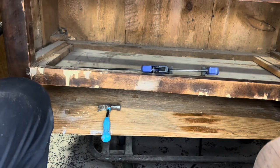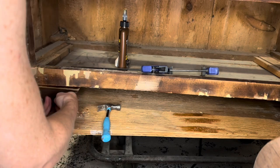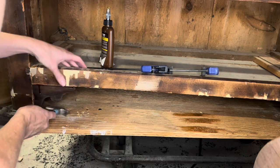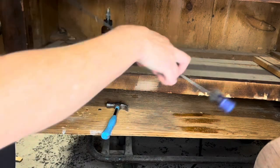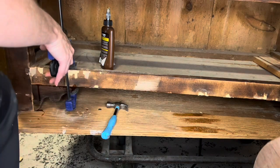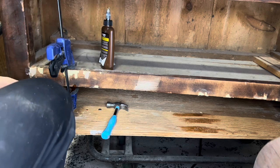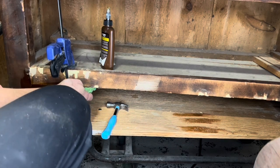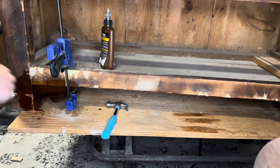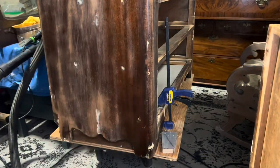And then that wood did not take the stain well. Again, it was old, you know, not the best. And I'm using that water-based stain, so we will change. You can see quite a bit of repair work that has been done on this. Here I'm just adding in that little piece that fell off. Thankfully the owner had kept it in one of the drawers, so that was really nice. But you can see all kinds of old wood fill, and then obviously new wood fill that I had to do, and this is that really thick veneer that they had used.